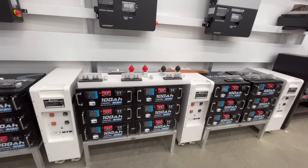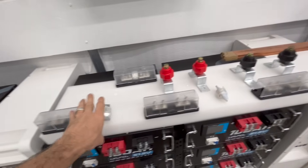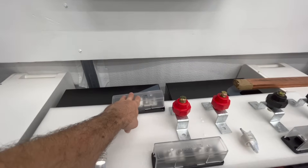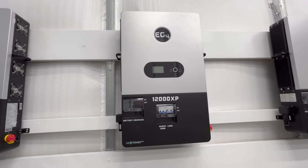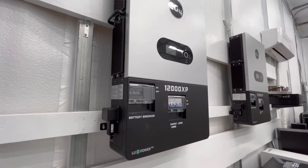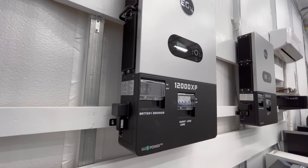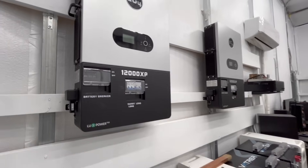The reason for all these T-class fuses is safety. These protect the batteries if there is an issue. This also protects me if the inverter goes south — say the inverter shorts out. I want to be able to definitely have this thing shut down. Now there are protections in place by EG4 and Lux Power for these inverters. If you have a failure it will shut itself down, which is very cool. Like when you overload it, it shuts itself down. So we have those protections in place, which is nice.